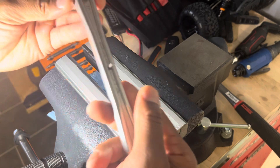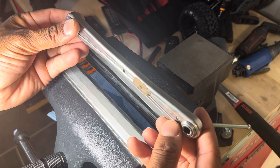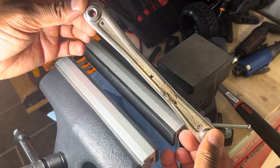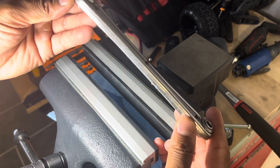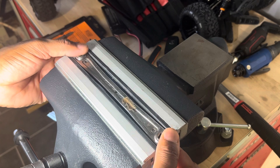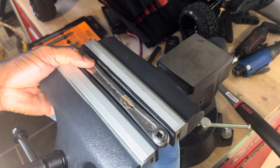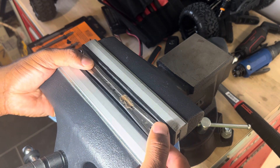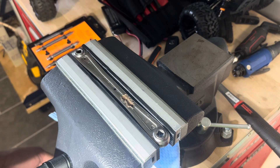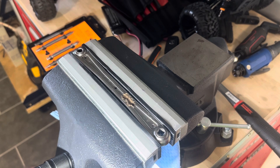These pins — so I'm basically knocking them out. They're like little pins in there; I thought it was like rivets, but it's not, it's just pins. So you can see they're already — I need to knock this one some more, but these are about to fall out. So I just put it in my vise here, and I'm using the cushion jaws here to hold it in place and cinch it down so it compresses that rubber.